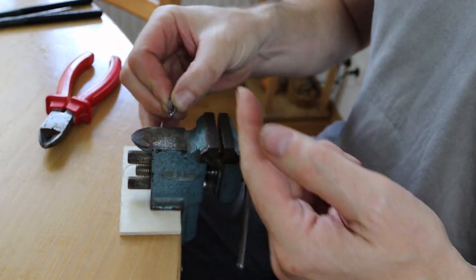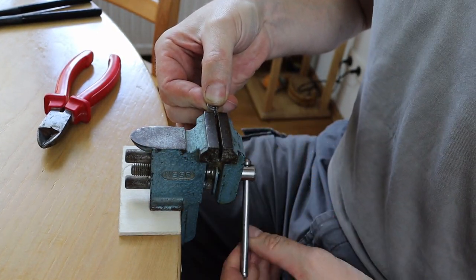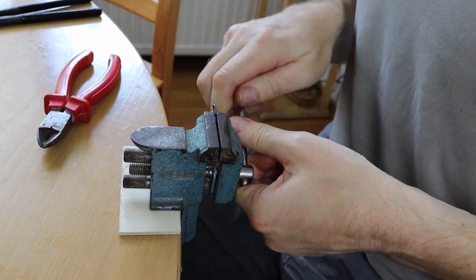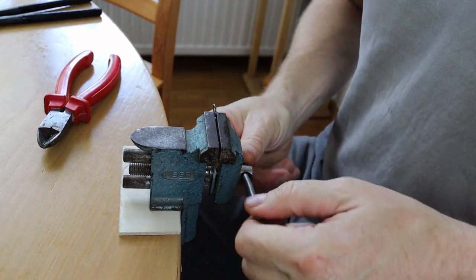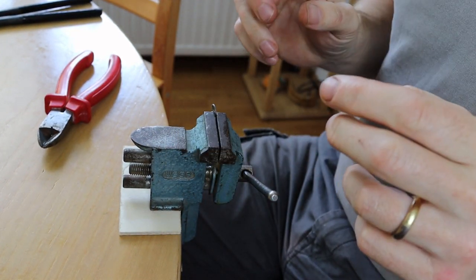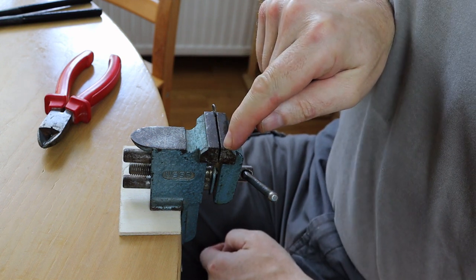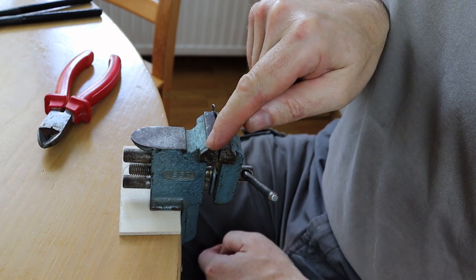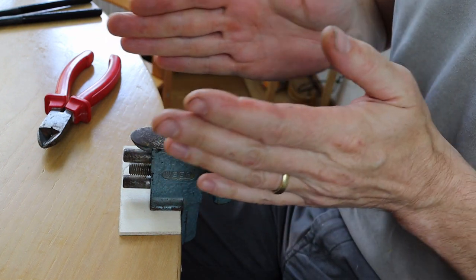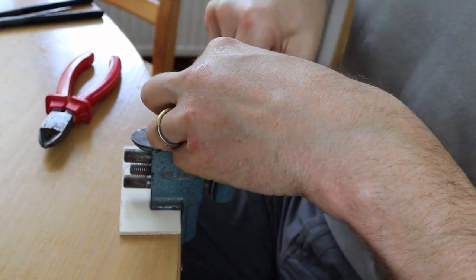Then we pick this up and put it into the corner of the vise and tighten the vise up. Now obviously this is quite slow, but as I was only doing an aventail it didn't really bother me too much. There is a problem — you are going to essentially start wrecking your vise doing this. You can probably see this has closed in a few millimetres on one side more than the other, so the thread underneath is getting damaged. It's worth swapping over: do one on one side, one on the other, and if you're only doing a small amount it's not a big deal.